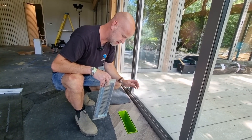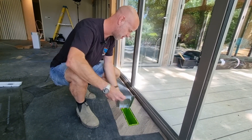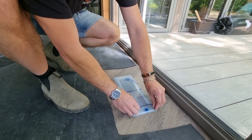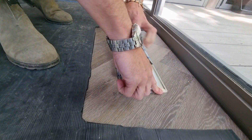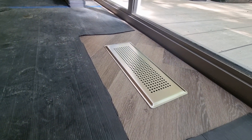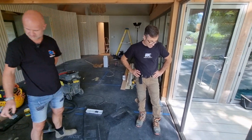The grill goes into the floor box. One of the most common problems is that if floor boxes aren't wedged nicely, the screed can push them in and bow them out of shape — that becomes a massive drama. But in this scenario, we slide the grill on like that and it's done. We take that protective coating off and we've got a nice brushed steel floor grill. They look really good — sleek, also available in white.